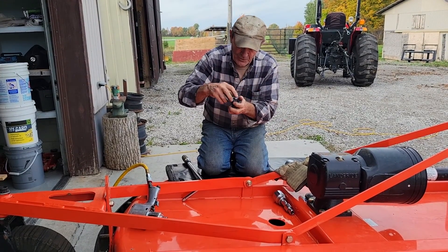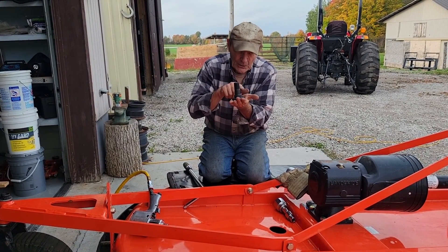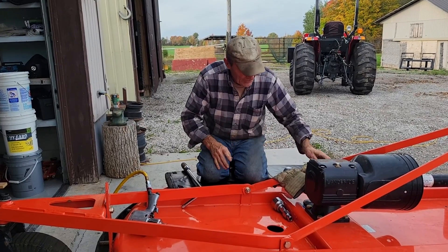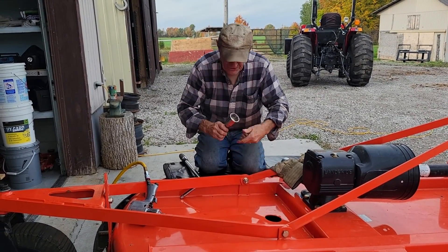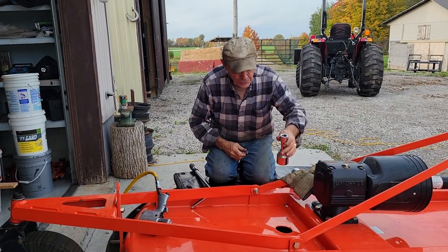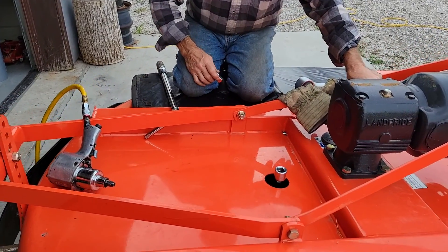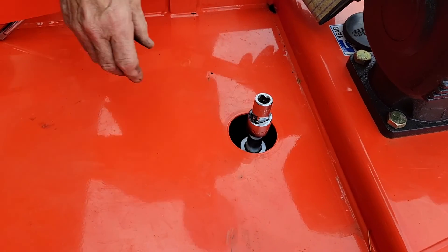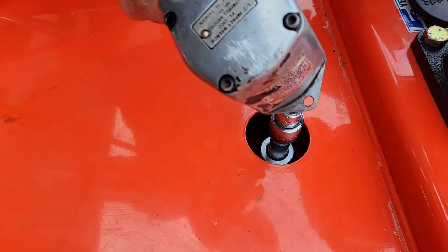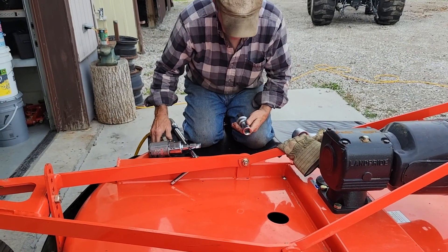Getting this up in there with Diana's help — my dear wife's help — getting the blade in place, getting the bolt up through and lined up with the key, and then the washer and the nut on from this side down through the peak hole is not a real big problem. I was able to hook up the wrench. It's an inch and a sixteenth, so I had to use three-quarter inch drive. Then I was going to use my half-inch ratchet wrench, so I put an adapter from half to three-quarter, and the ratchet wrench goes in. You give it a spin and you're all set to go — a bit of a Mickey Mouse arrangement, but it works really well up to this point.